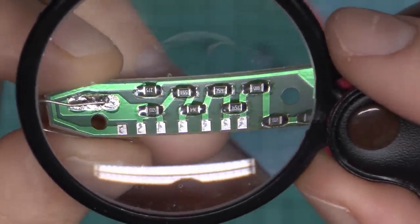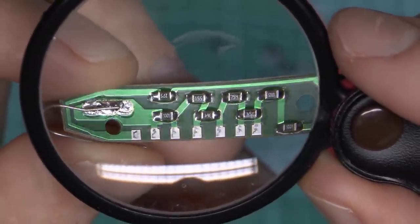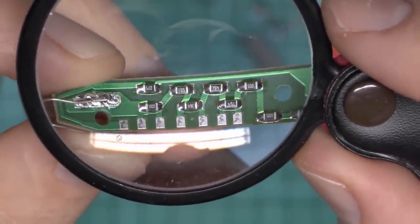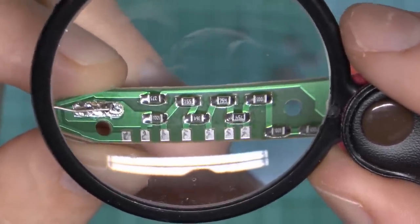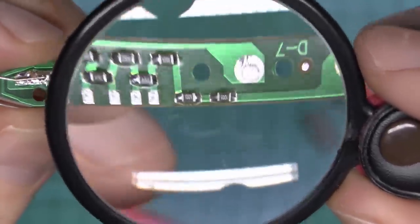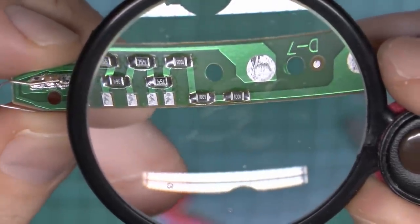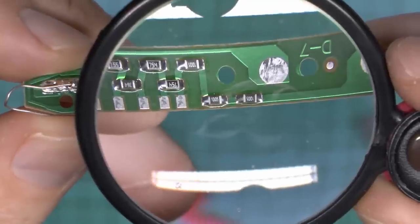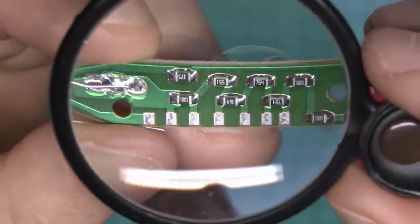And the one that's marked inductance, which, bearing in mind, doesn't actually go directly to that input pin. It's sort of around the bottom there. And what's that, 275? So that's 27 and 5 zeros after that. And then right at the top here on the output of the chain, okay, it's the 1005, so 100 with 5 zeros, so that would be the 10 meg. Anyway, all pretty high-value resistors.